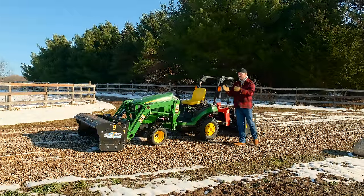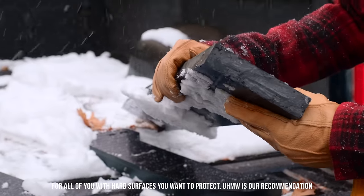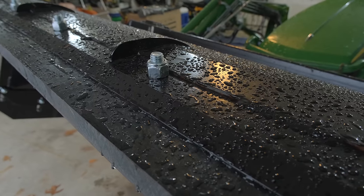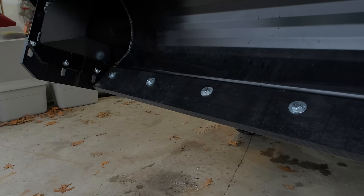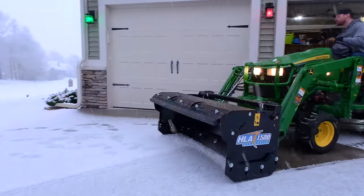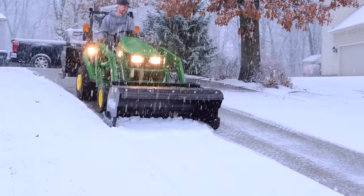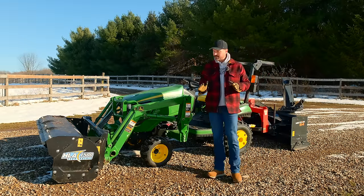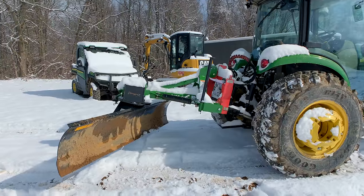What's the best material to use on your snow removal equipment? Up front we have the hard plastic, the UHMW. Back on the snowblower, we have steel skid runners and steel edges. I would suggest sticking with steel anytime you're going to be on a really abrasive surface like gravel. The UHMW is marketed as being as hard as steel, but gravel is pretty rough on it. An interesting technique I'm actually going to try out this winter for the first time is using a tool backwards — specifically a rear blade.